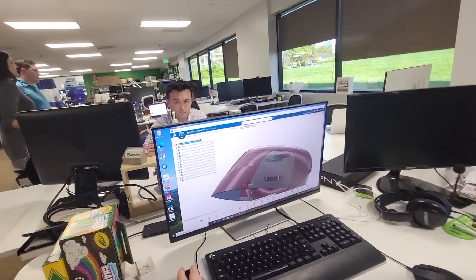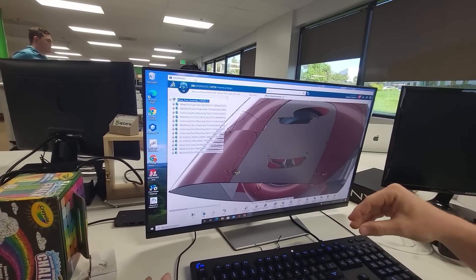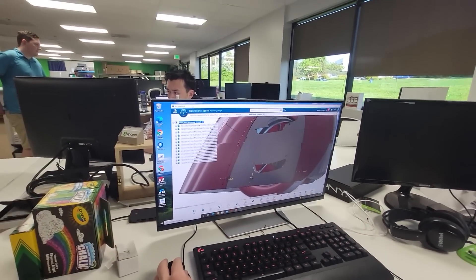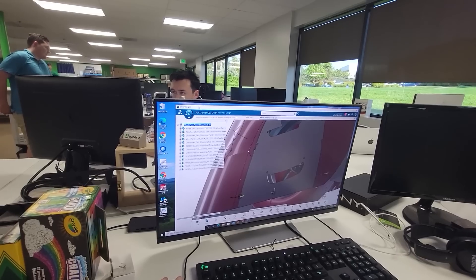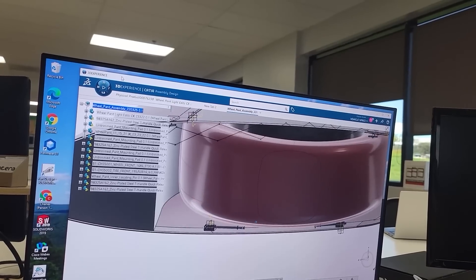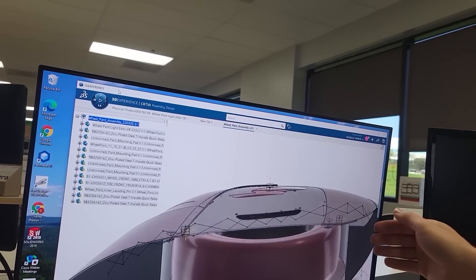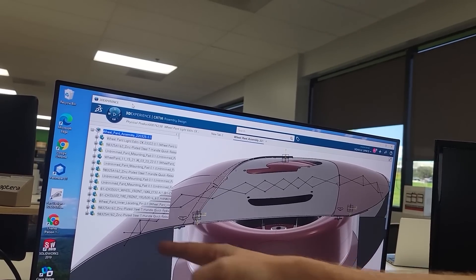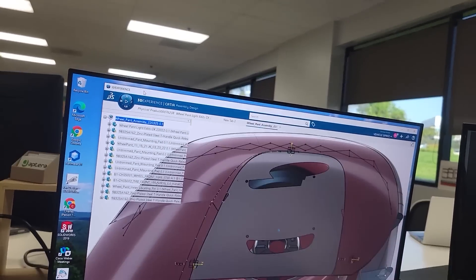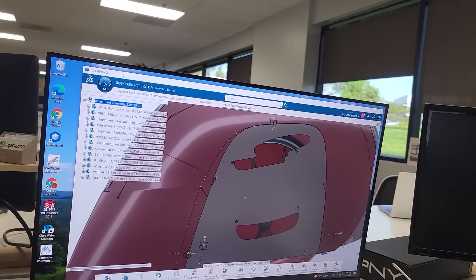What we meant by full coverage is that this second piece is mounted permanently to the hub carrier and does not have to be removed for changing a tire or replacing a wheel. The outer wheel pan is made with an inner liner that first protects the inside of the wheel pan from damage, but also prevents having airflow get caught at the back of the wheel pan. This covered section forms a closed section for structure, making it more rigid.